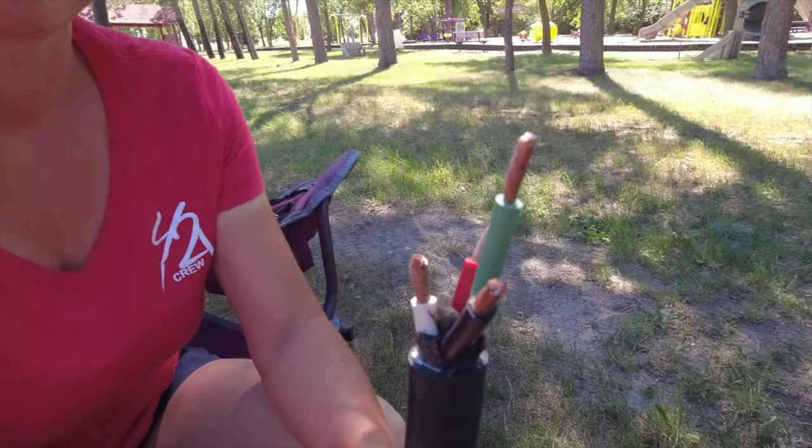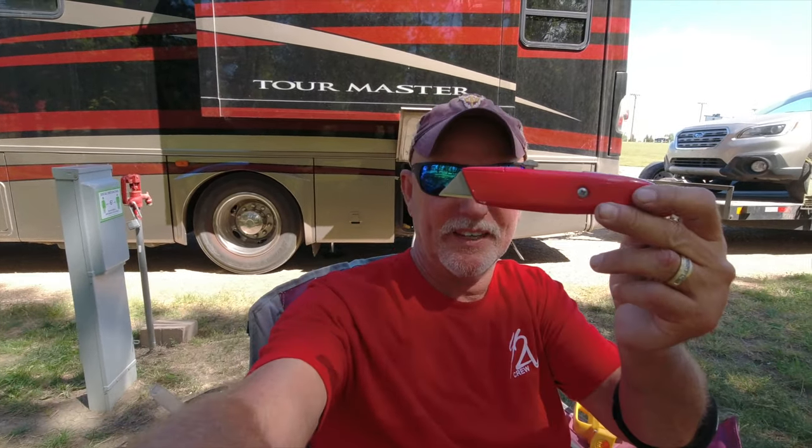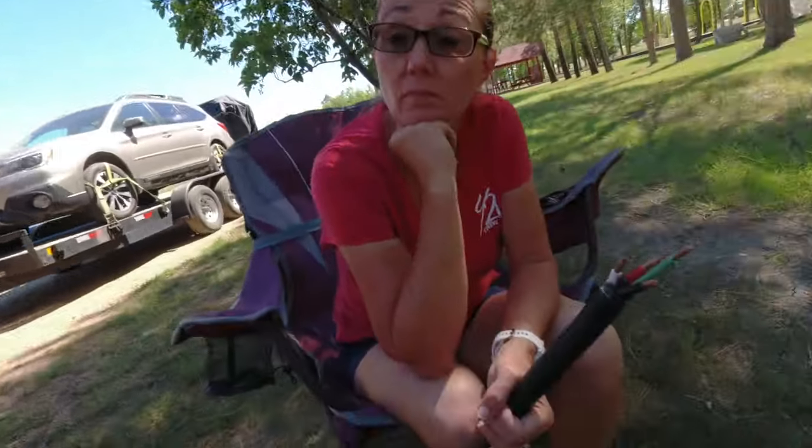First recommendation: use a pex cutter to cut the wire. You can also use the pex cutter to cut a ring around it at a certain depth so it cuts a nice ring and you can pop off the sheath. What I ended up using was a regular box cutter with a sharp new blade — just make a slight incision and the wire will break and separate apart so you can pop that thing right off.